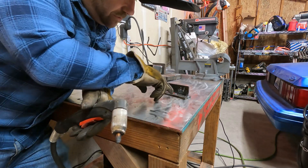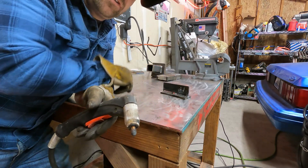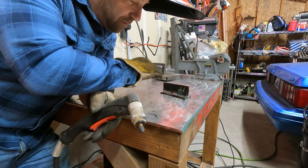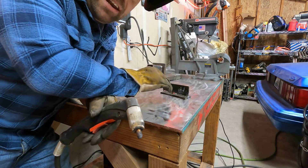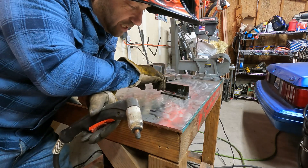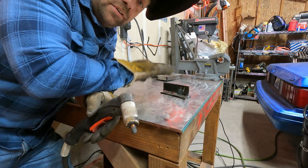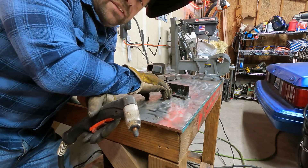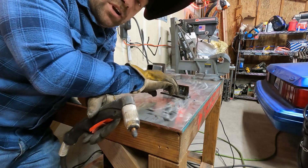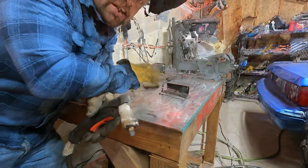What I like to do — you can see there I was kind of washing back and forth. A lot of times I'll take the majority of the weld out with my first pass, and now that I've got it down close to just the original two pieces of base metal, you can really get in there and fine-tune. You want to get in there and find what I like to call the crack line. Once you get that initiated, it's pretty simple to follow that thing right on out.